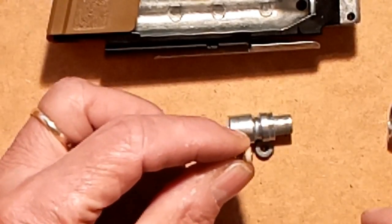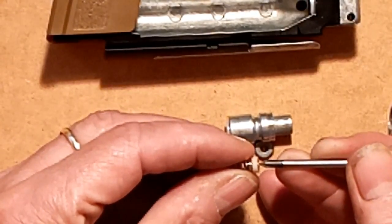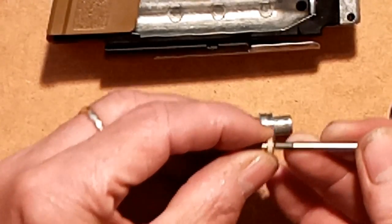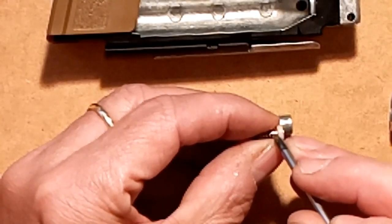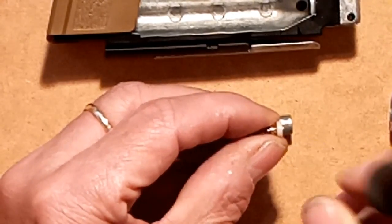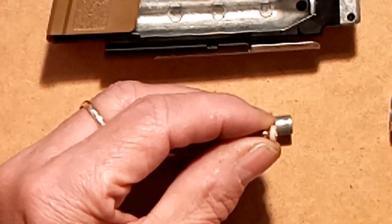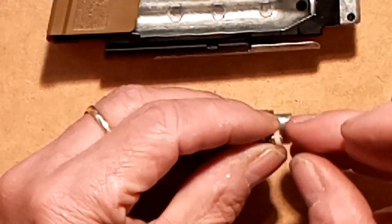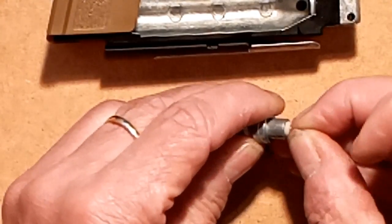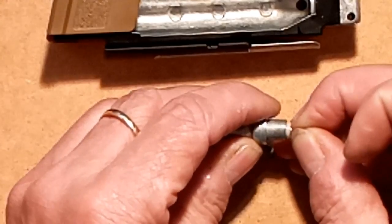Now when you insert the cartridge into the gun, a small pin in the gun itself pushes down onto this brass piece against the spring, moves it down, which then opens up, or it breaks the seal between the brass and the PTFE, which then allows air, or CO2, to pass into the cross-drilled hole and then out through this hole into the gun itself. Now, the place that leaks is where this PTFE round white seal actually seals on the outside of the casting, where it's not a very good fit in there, and that's where the leak of the CO2 comes from.